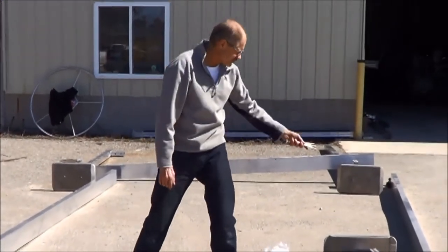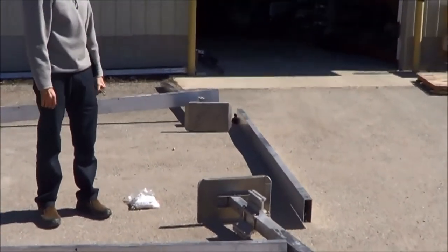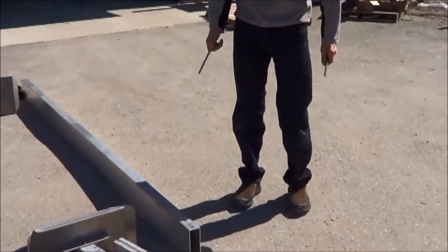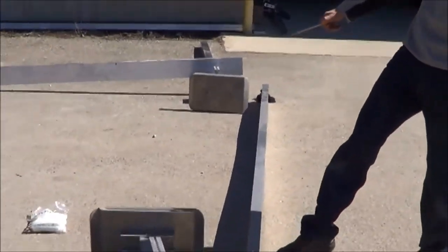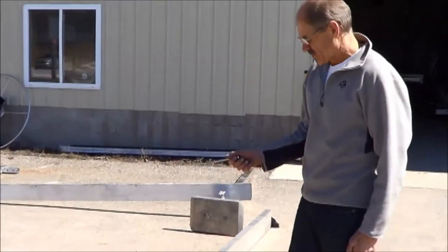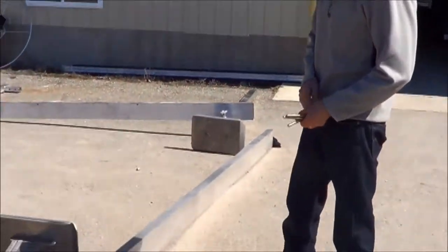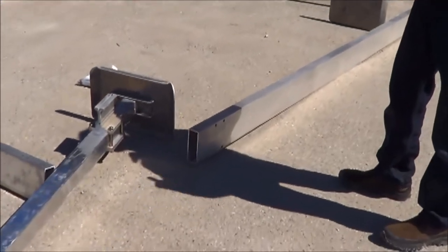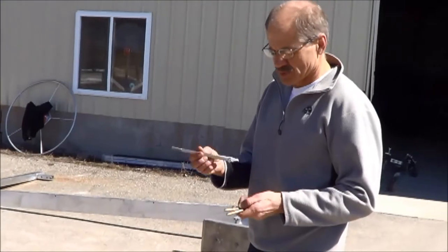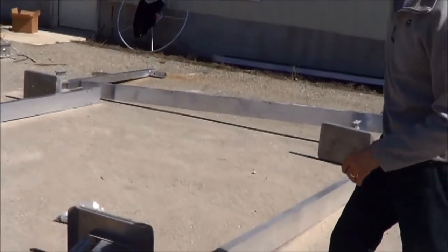The spreaders, we call them, are going to be 119 inches long. They may have four holes drilled here for some bracing. That is for the 8,000 pound lift, so if it has holes, don't worry about it. It's just kind of a multi-purpose part. We aren't going to put the bracing on this particular lift. Anyways, I just grabbed a few 3/8 by 7 bolts out of the frame bag, which is laying on the ground there. It's easy to get at them here.